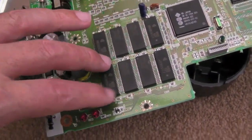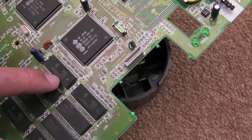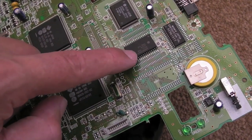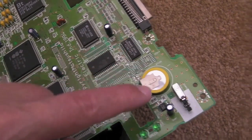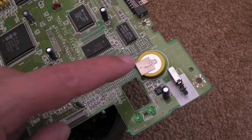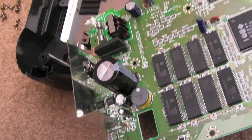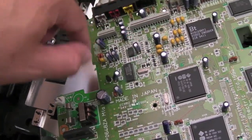There are some RAM chips down here — Kyocera. That looks like a ROM, that's a RAM, presumably video RAM or backup RAM actually, because you've got the battery here — that's probably going to need swapping out, I've got one of those spare, so I might do that while I'm here. And then of course your power supply caps — could be one of these. I need to check these caps out — I'll get them off and measure them on the capacitance meter and give the board an inspection with the magnifying glass, paying close attention to the power supply area.